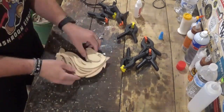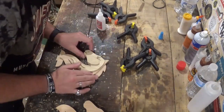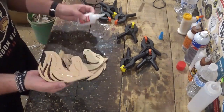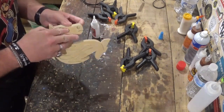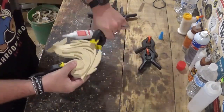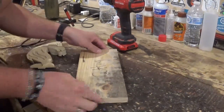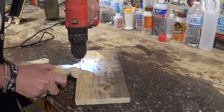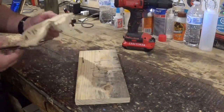Consulting the photo I have saved on my phone, we'll begin gluing everything together. Keep in mind each side that glues onto the central area is a mirror of each other, so you don't want to mess up during the gluing. I let all the CA glue cure for around five minutes before taking the clamps off and proceeding with the next step. This will be the final glue-up here, and everything is lining up beautifully. Once I'm happy with how it's lined up, I'll again use spring clamps and let that dry for around five minutes. Then I'll drill a hole in the tab to hang the horse from a hook to dry once we stain it — this will be hidden once the tab is glued into the base.